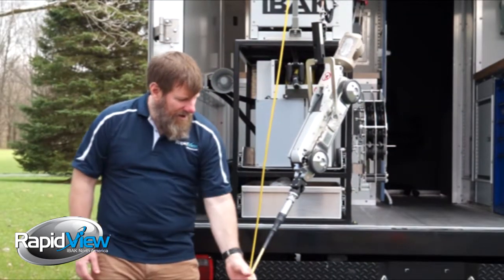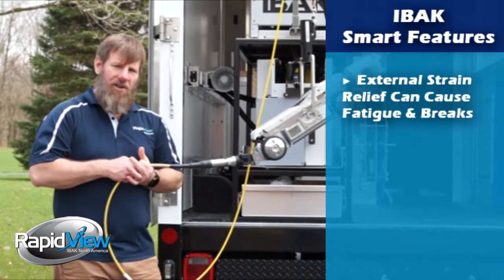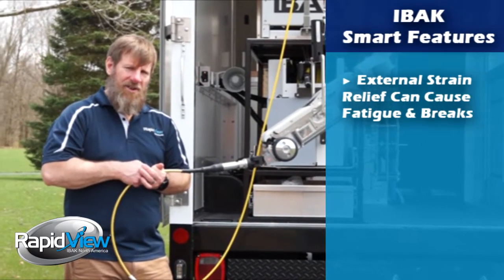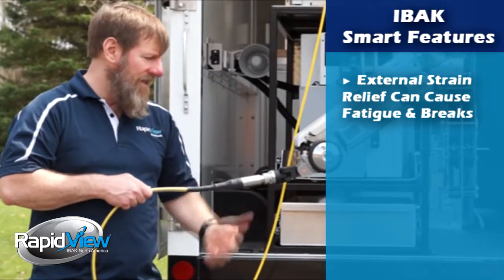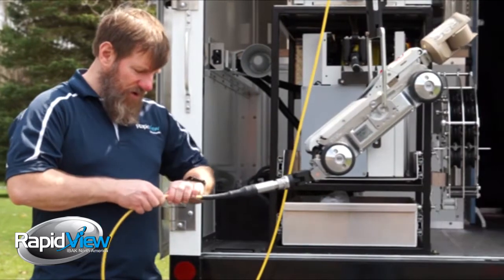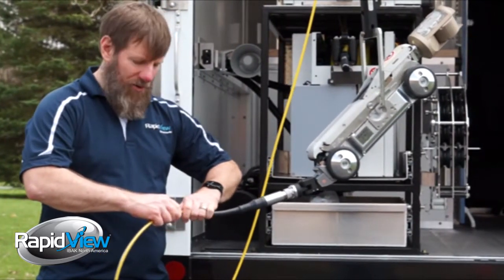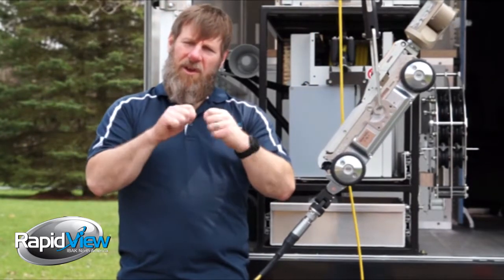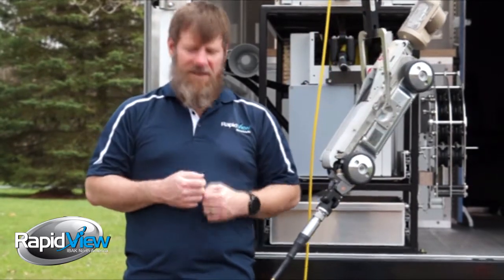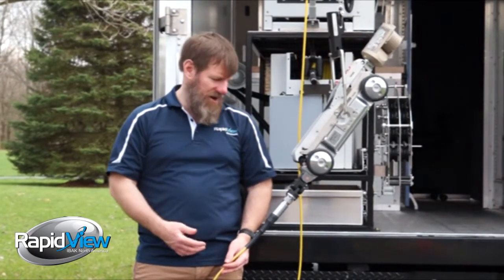It's mainly because you have an external strain relief. It's two cables that are external that clamp on — you have a block that clamps onto your cable here. That's protecting this connection here. So as the tractor moves forward, that connection kinks the cable this way, and every time you pull it back, it kinks it the other way. You take a piece of copper cable, wiggle it back and forth 50 times, and eventually it fatigues and breaks. So you're doing a re-termination.